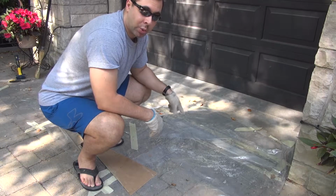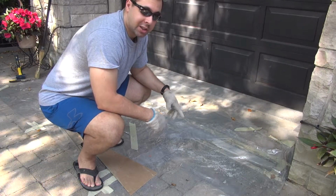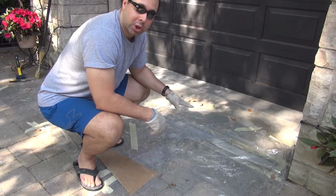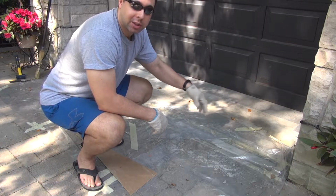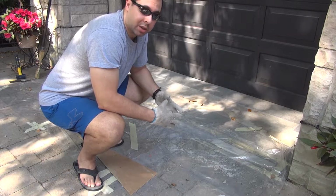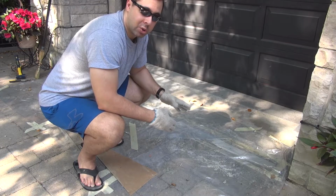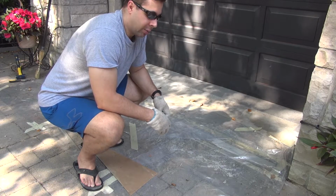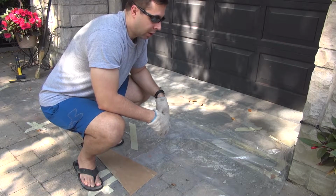So there are a couple things that flow from that. One is too much water is not good for concrete. So unlike something that just dries up, if you add too much water, basically water stays in between the crystals, so it takes the place that should be taken by proper concrete. So that makes it weaker. So that's why there are always recommendations not to add too much water, just as much as needed by the manufacturer, otherwise the concrete is going to be weak or weaker.